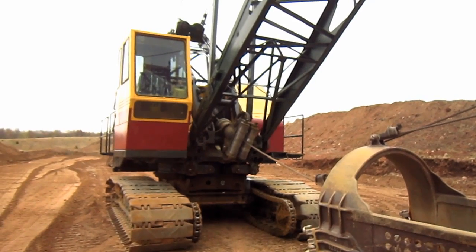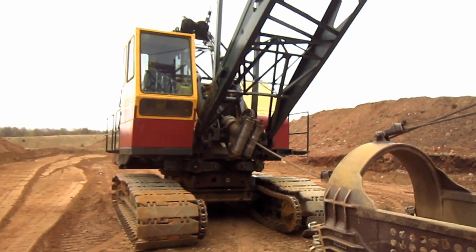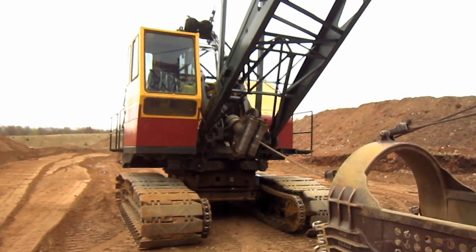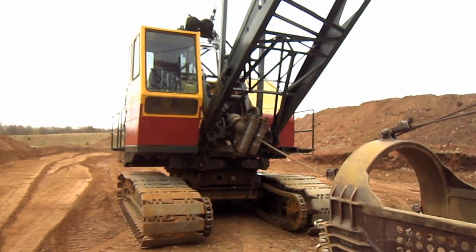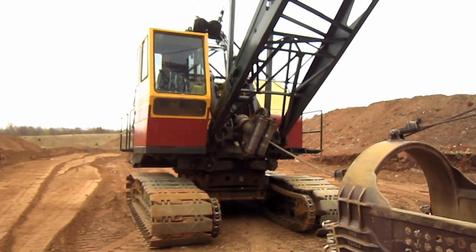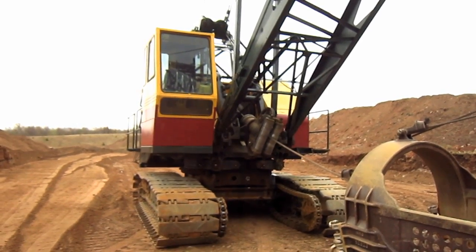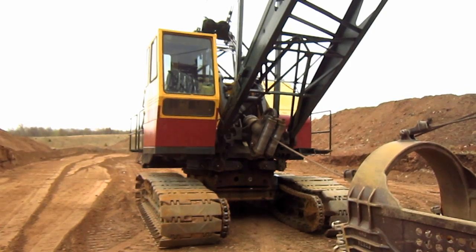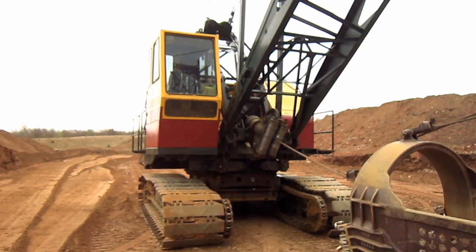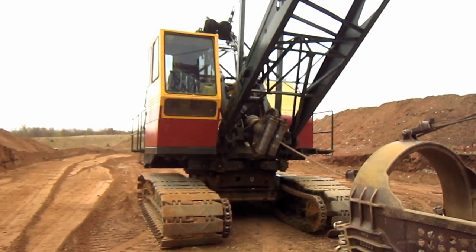The 71B incorporated many design features of the 54B and 88B. The most noticeable design feature that resembled the 88B was seen on this machine's front shovel attachment, which featured a twin-rope balanced hoist and crowd system, just like on the 88B. This feature was designed to eliminate shock overload and excess power demands, and to prevent speed increases at critical moments, overcrowding, and wasted operating time.